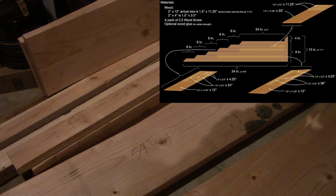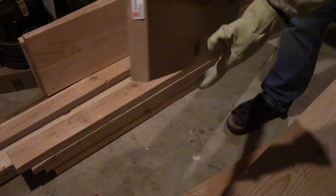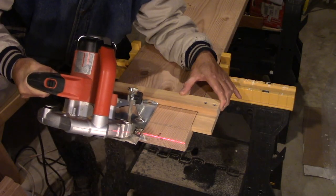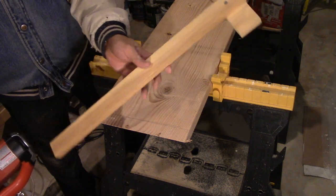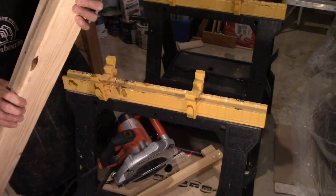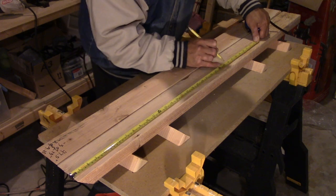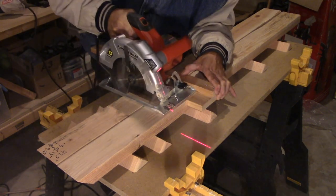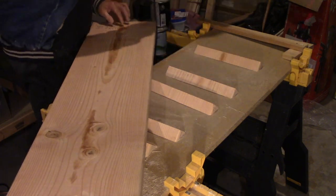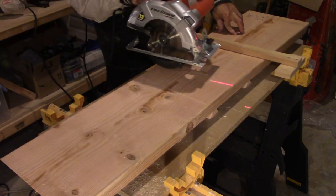Let's build 1 ramp at a time. I'm gonna start from here. I want it beveled. I'm gonna cut here at 45 degrees. Useful guide, I made this myself. Square T. So I'm just gonna measure 13. So let's cut it. See. The guide, red light.